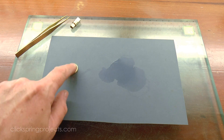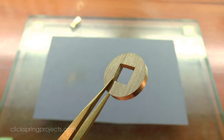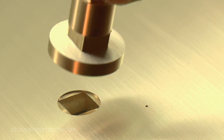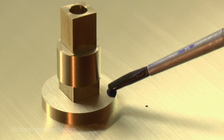And you'll have noticed that a small section still needs to be removed from the perimeter of the spacer. It was a clever little dodge, used to keep the head on a nearby rotating hub as large as possible. So with the bearing resting in position, I used a divider to mark out the clearance arc, and then used a series of hand files to remove the metal.